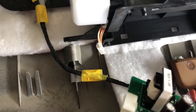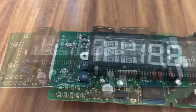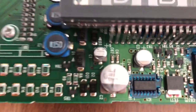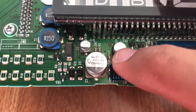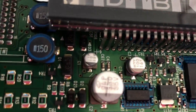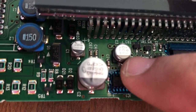Once the board is separated from the housing, be careful not to damage the ribbon. Here on this corner is the white clip that the connector was attached to. This is the display board removed from the housing. The capacitor causing the problem is this small capacitor rated at 100 microfarads at 16 volts. The black marking at the top indicates the negative side of the capacitor.